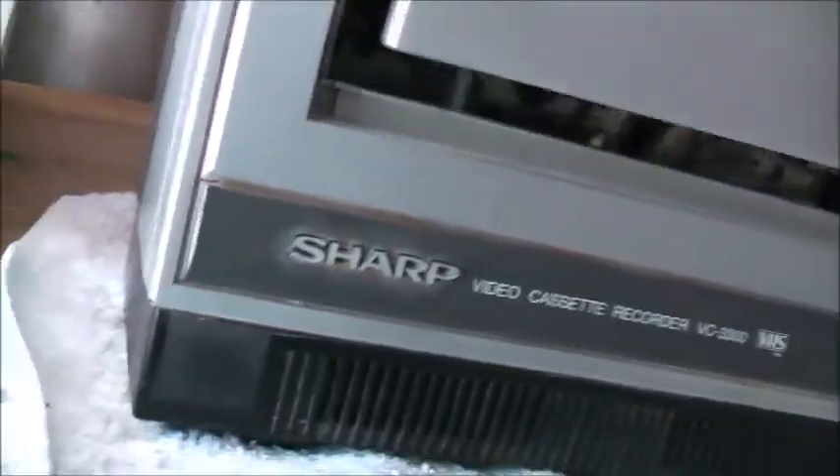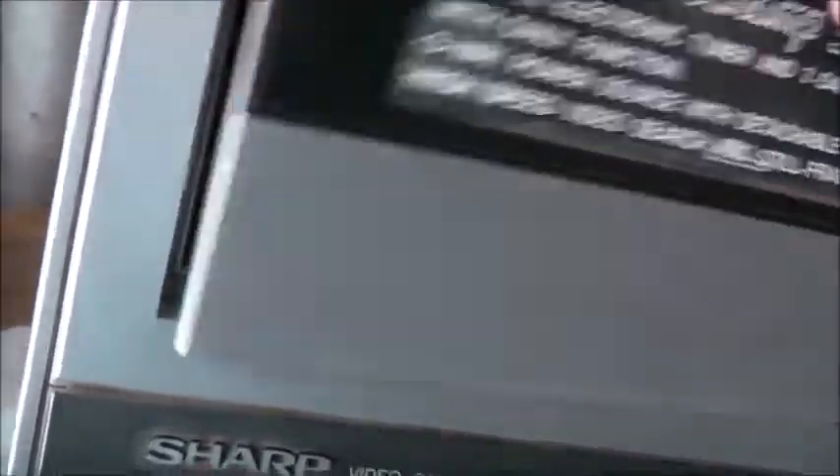I've got to get a TV so I can hook it up and test it. The problem with these modern TVs is they say no signal — they want an actual proper video signal from the start to lock onto. This is where an older TV is definitely best, because an older TV will pick up something no matter what — there's a form of static and you can actually see if it works. So we're going to play The Jetsons. Nothing. I might not pick up the signal with this TV — it's got to be an older TV.